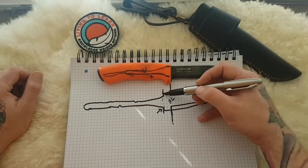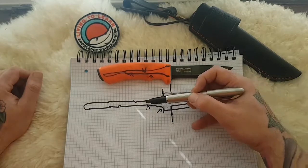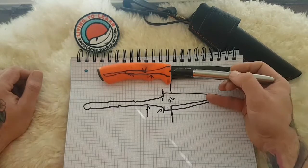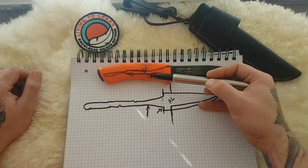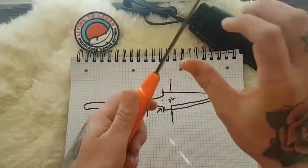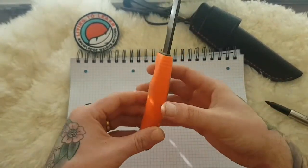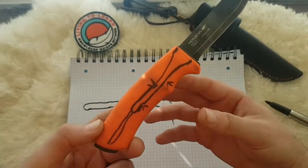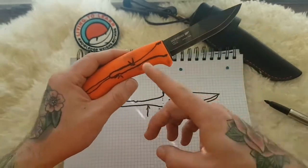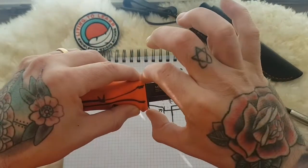And then by taking it back in here, the weakest point on this blade, you would assume, would be skinniest at the neck, where this tapers in for your pressure fits. So to combat that, by moving these up over the plunge lines, they now have recessed the weakest point into the handle, which you can see here. So there is no way that that is going to be affected by horizontal pressure. It's just not going to happen. You've got a full 10 to 15 mil of TPE or PP type plastic, depending on the model you've chosen, encased around that handle. So you're not going to be able to force that up or in or through or around the handle, and you've got all the strength up here.